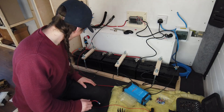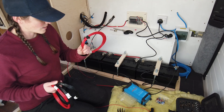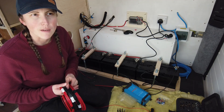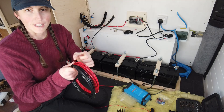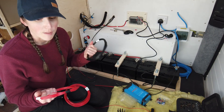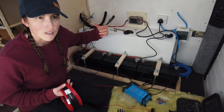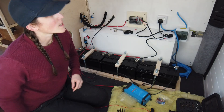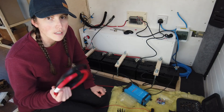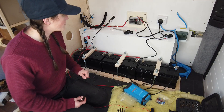I've ordered quite a bit of cable: some red and black 2.5mm, because that's what I've run all my lights in — although I've run that in double insulated cable, which is basically two wires inside another insulation. I also bought some 1.5mm red and black. I read that it's best to keep your cable thicknesses the same, so where I need to extend cables for lights I'll stick with 2.5mm. I also bought some cheap spotlights to go under the cupboards — they have really thin cable — so I'll use the 1.5mm for connecting those.